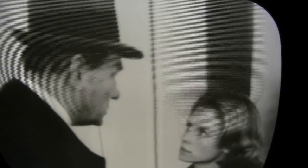I'm doing a final check before I put this back in the cabinet. And I've noticed a few things. One is that those retrace lines are kind of annoying, so I think I'm going to have to go back and see about adjusting those resistor and capacitor values. To make them go away entirely, I do have to make the picture pretty dim.